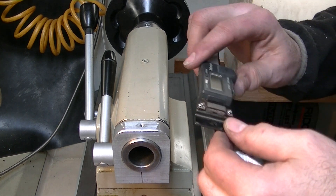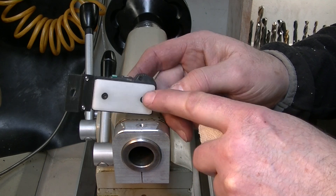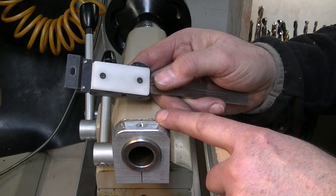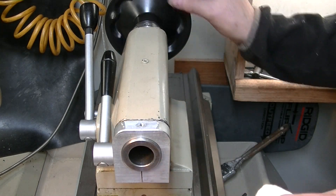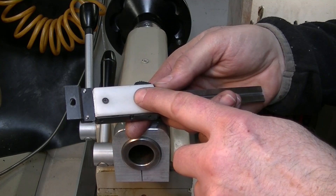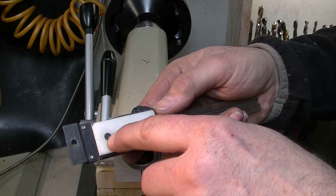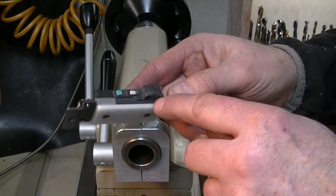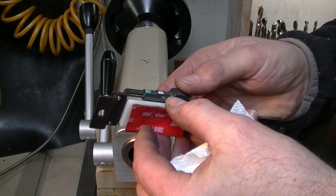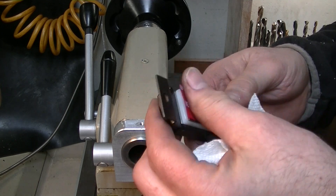What a little nightmare that was. I had to cut a piece of plastic out of a bigger chunk — I did that on the chop saw. It took 4 or 5 attempts to get it just right; hard to measure even when marked with a scribe line. I also missed a step: the tape doesn't go on the caliper, it goes on the scale body. I needed to drill a couple of holes and countersink with 3mm flat head screws that screwed into the body, which became the spacer. To this I'm going to apply the VHB tape — it goes on like that, peel this off. It feels like it's on really good, really solid.